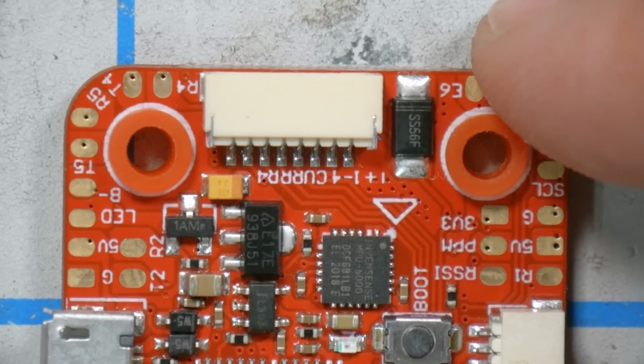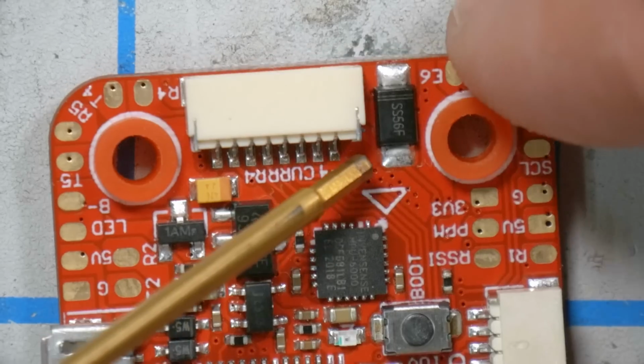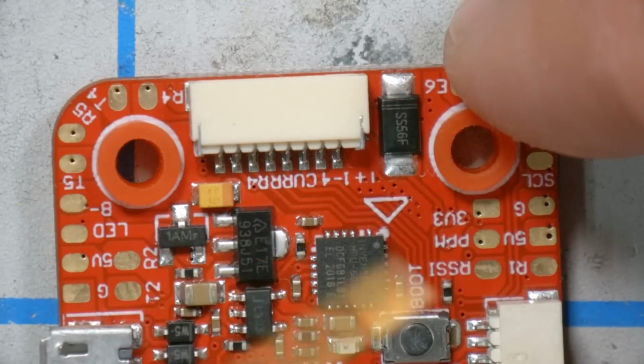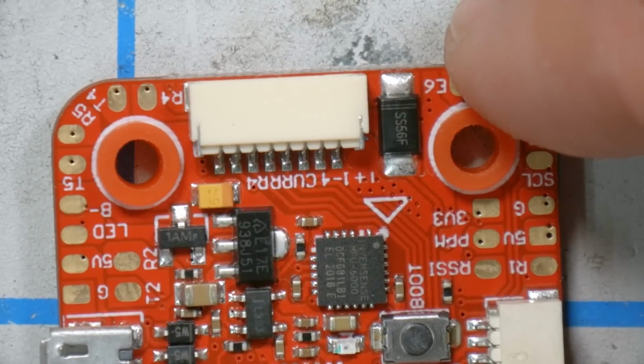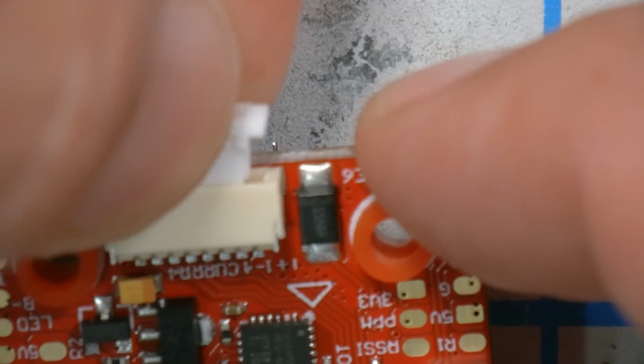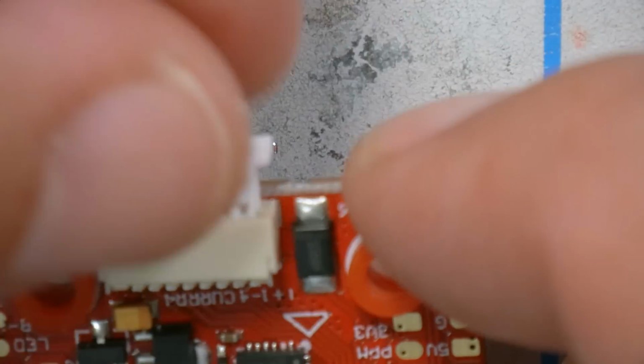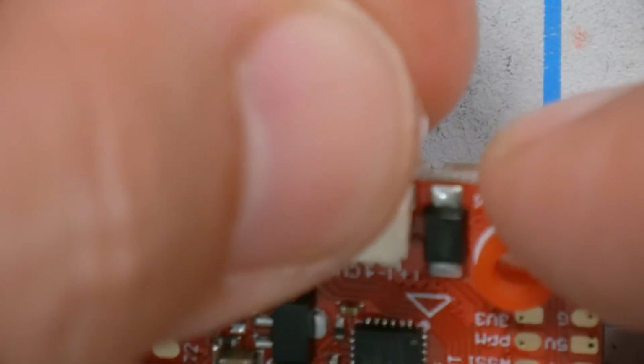And here is our pin out for the Aikon. And I always like to refer to the silks. I mean, they got a printed pin out as well. But I always like to refer to the silk screen if there is one, because I think it's just one less step to mix up. So then again, to make sure I get things in the right order, because what if you accidentally pin it out upside down? What I like to do is just plug in this plug right here.